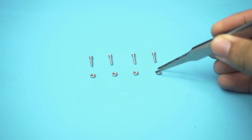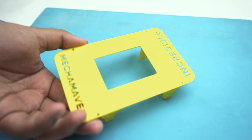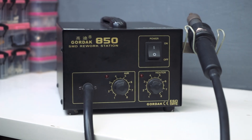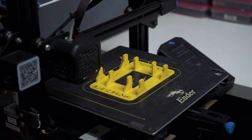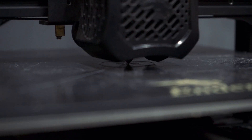You'll also need 8 pieces of 2.7mm x 29mm screws and their nuts, 4 pieces of 1.8mm x 10mm screws and their nuts, a 3D printed spacer, and a 3D printed body. For hand tools and fabrication machines, you will need a soldering iron, a soldering pump, soldering lead, a hot air SMD rework station, solder paste, tweezers, and a 3D printer to print the body of the robot. The first thing we need to do is print the body of this robot, followed by printing 4 pieces of spacer.